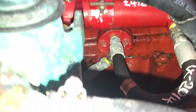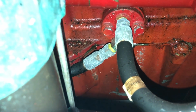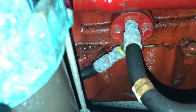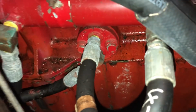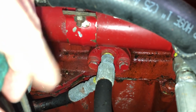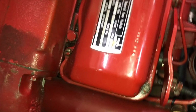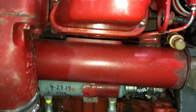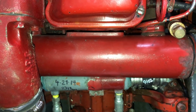And then on the underside of the oil cooler you can see the connection to the engine block, where hot engine oil, and actually I don't know if that's the hot side or the cooled side, emerging here, and the other one's below. So you got hot oil coming out of the engine. It gets cooled through the saltwater heat exchanger and puts cool oil back into the engine block. The raw water flow continues along to the next heat exchanger, which is mounted on the aft end of the engine. It's this large cylinder. I have not replaced that in the 4 years we've been running the boat.